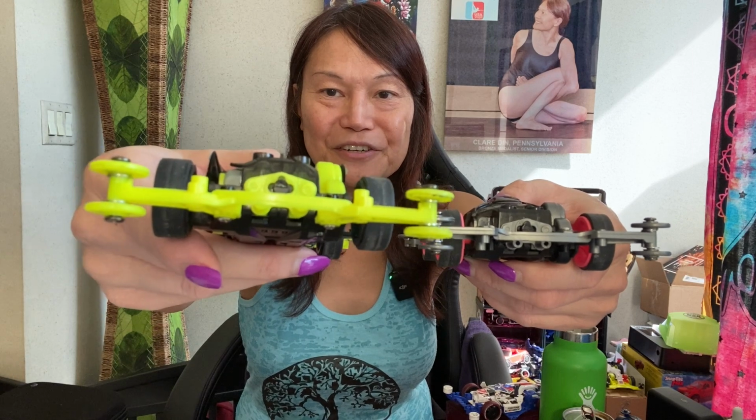So I have an example right here. I attached this like so. And you might wonder, well, what's the big difference? Why is that not allowed? Why is that a DQ? I'm going to show you why. And it's a subtle reason, but it's a valid reason. It's the same reason that I gave in the last video for this brake being on the front versus the back. If you place this brake on the rear 2 holes, you can definitely put the brake on these 2 holes here, but the big problem is it will likely not clear the 1 millimeter clearance underneath.